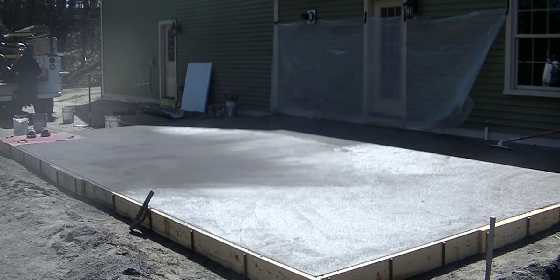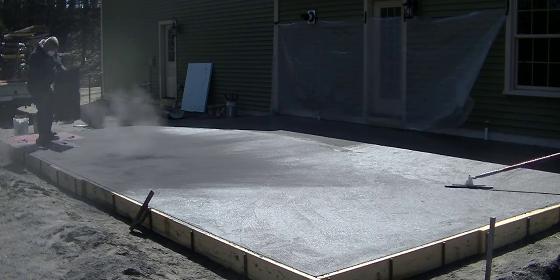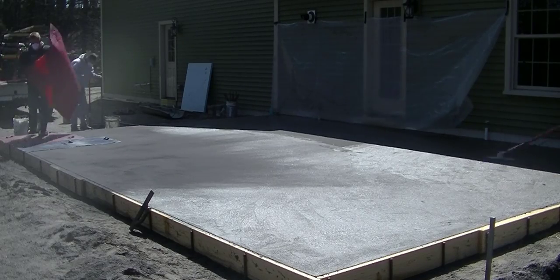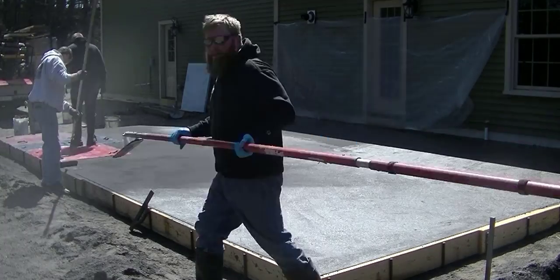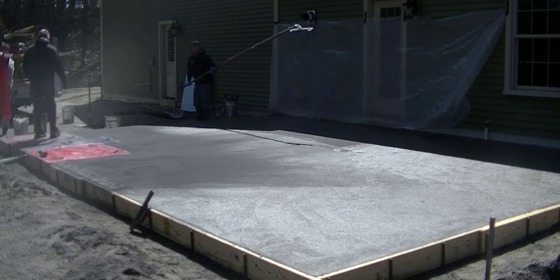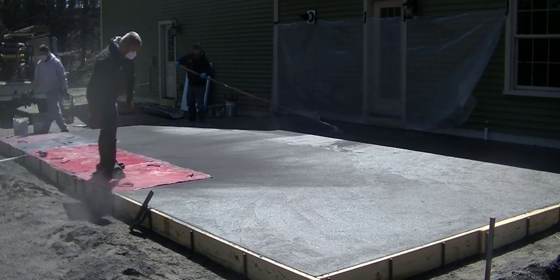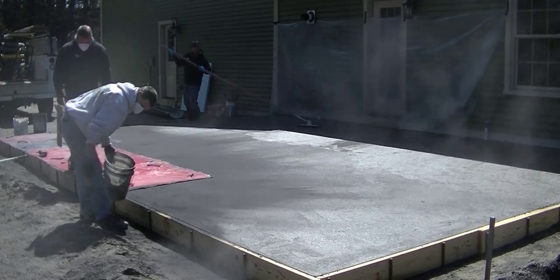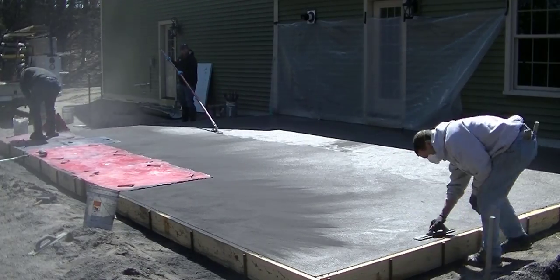We decided to use the powder on this one. Some people like the look of the powder afterward, while others prefer the liquid for a less messy process. We do both ways depending on the job. Darren was finishing up mag floating the piece in the shade — that section isn't curing up as fast, so we'll have to wait a little on it. In the meantime, the sun's been beating on the other edge, so Luke and I are coming down that edge now using the rock texture stamps.